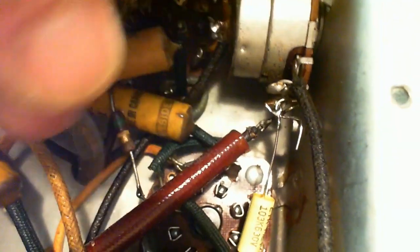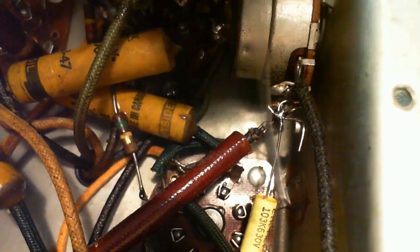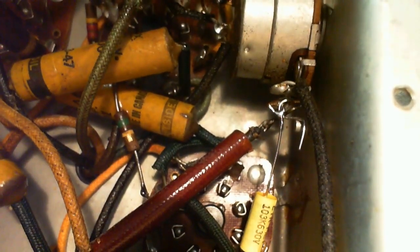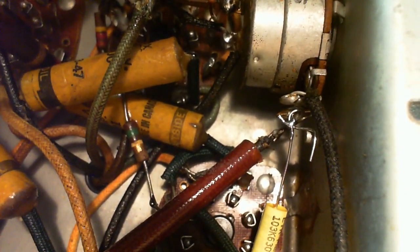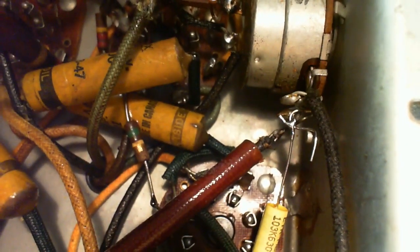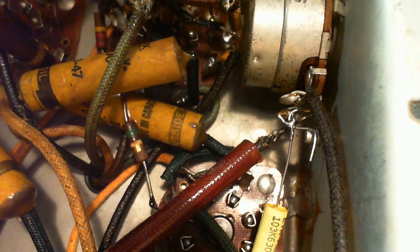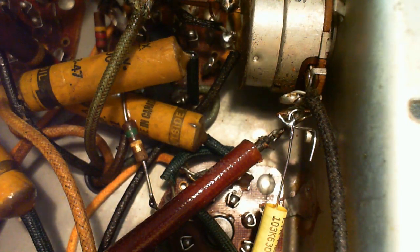Oh, I didn't do the other end of that. Did I solder that? I can't remember. No, I don't think I did. It seems to me, from my experience, about half the time I get diodes in backwards. Try as I may. So I always hook up a meter right away and check. It's always something stupid too that gets me to get it backwards. In this case, it was not connecting the voltmeter correctly and thinking I'm seeing a negative voltage where there should be a positive. That's all bogus. So that's what happened back there.